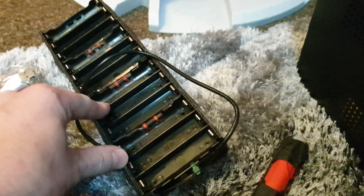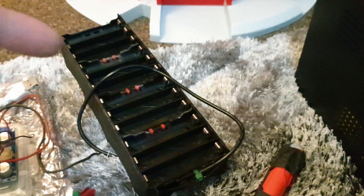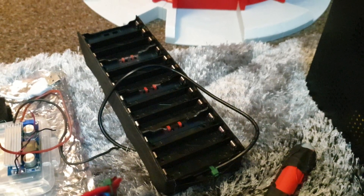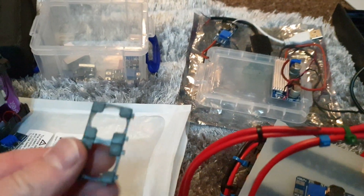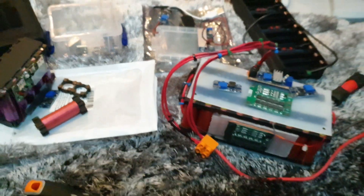Don't use these pin connectors because they're rubbish — the pins start getting quite hot. They're okay for low currents, but if you want to use anything above two amps, definitely use these proper connectors instead. Let's turn that UPS off.